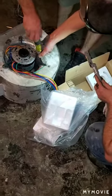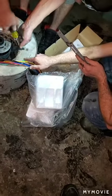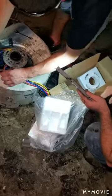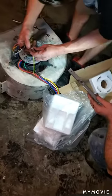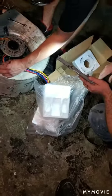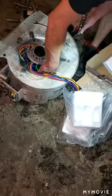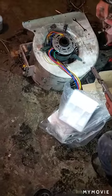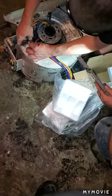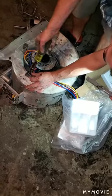No air. Don't forget your ground wire. Through there. Yep. Hate when that happens. You get it? Yeah. These furnaces have to have a ground with that board, the way it senses flame.